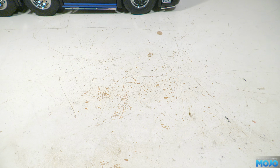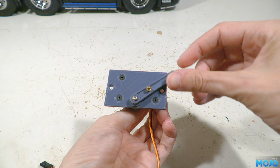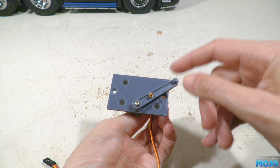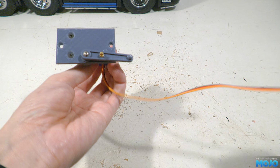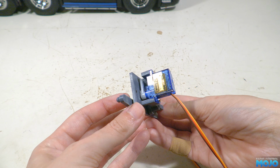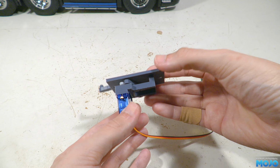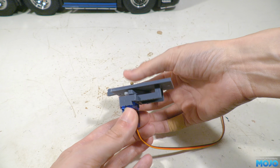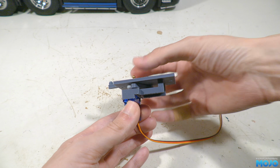Enter the new version of the servo mount, which of course is 3D printed. Files for printing your own will be on Thingiverse, and there should be a link in the description. Now, it all fits within the same footprint as the stock Tamiya plate. The lever is free to move, so the coupler can latch a trailer without having to manually open it. And it has a servo that can mechanically override the lever to open the coupler from the radio.